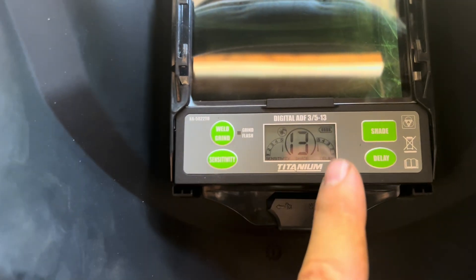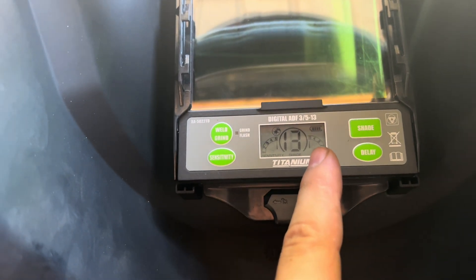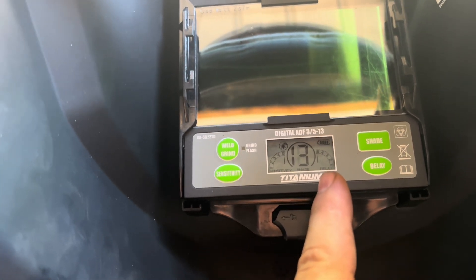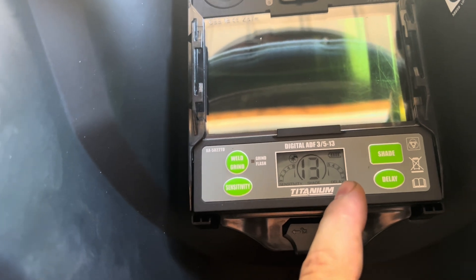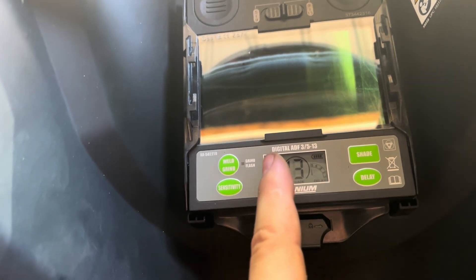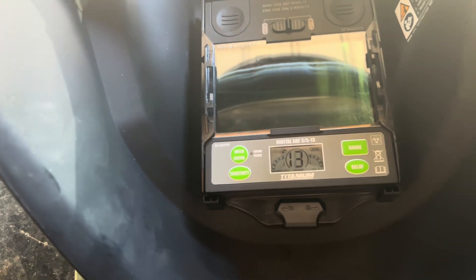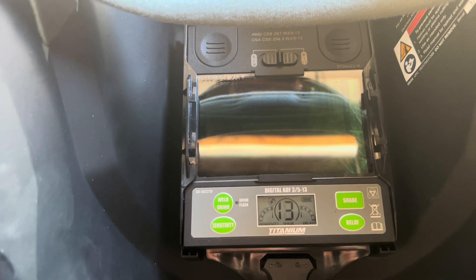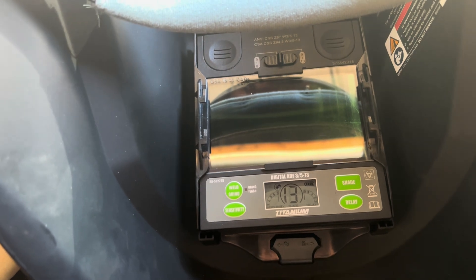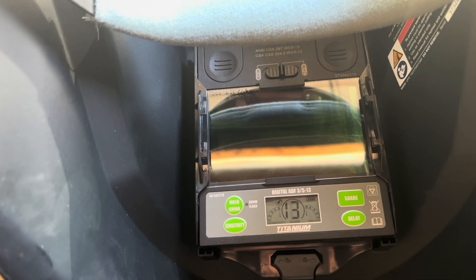You might be wondering what this delay of five seconds is. This is how long the screen will stay black. If you put it to one second, basically as you weld and then stop, the screen just turns off — it turns black — and each time you press the trigger it quickly catches it and turns it black. But because I set it to five, it's easier to explain, because the screen actually stays on longer — that's why I set it to that setting.